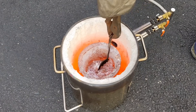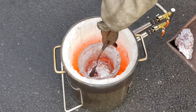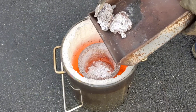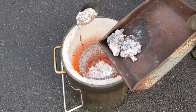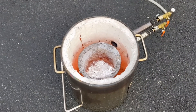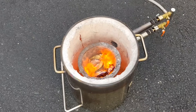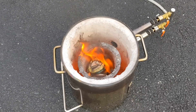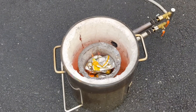Now that I've melted down a bunch of cans, I have to remove some of the dross from the top of the molten metal. This dross is just the impurities in the metal, as well as the plastic liner on the inside and the paint from the outside of the can — this stuff is no good. So I'm going to continue adding more aluminum cans, and when that's all finished I'll do a final scoop off the top of the molten metal to clean away any of the remainder dross that has floated to the top, and there will definitely be more dross.